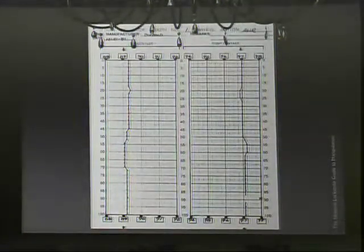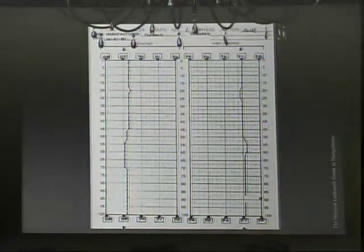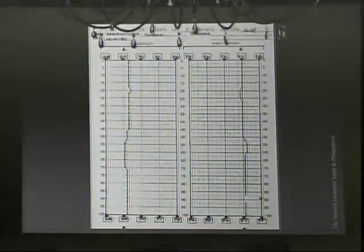It's pretty simple. To take advantage of this, you create a map of the radius of the wheel pack. If you're a mathematical type, you'd call it a map of the radius of the wheel pack as a function of angular position. You turn the dial three times to get all the wheels moving together, and then at every particular position you map the radius of the wheel pack, that is, how far away the contact points are. The contact points get further apart as the wheel pack radius at that point goes up, and closer together as the radius goes down. That means where the contact points get further away, there probably isn't a gate in the wheel, and where they get closer together, there may be a gate in the wheels. Exactly how this works is a matter of practice.